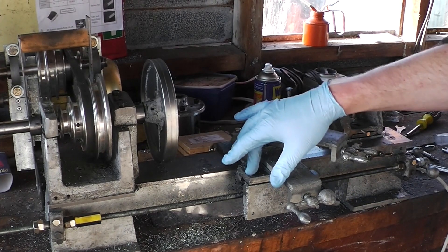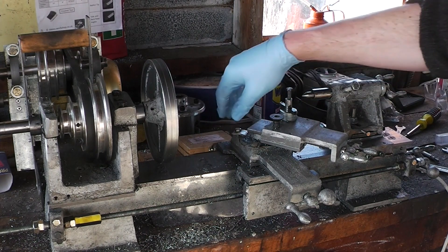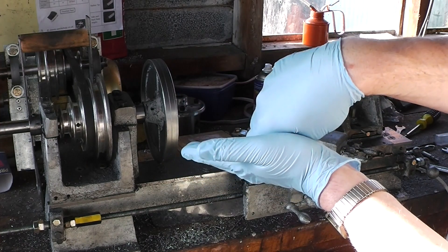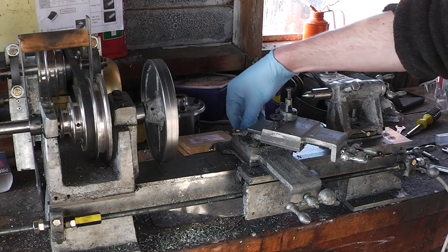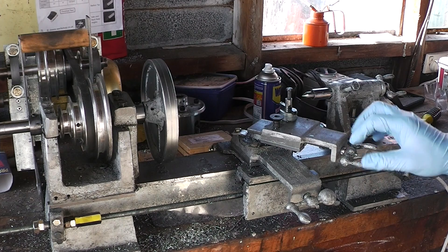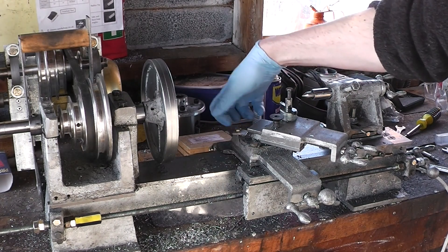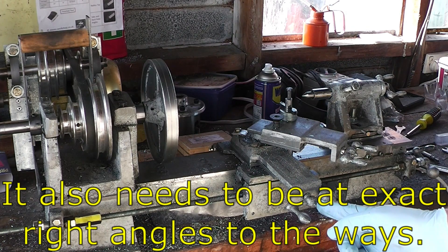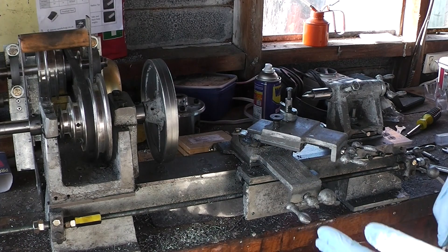Moving on to the carriage — this is class 102 in scraping, because now you've got to work in the corner, having to work your scraper without hitting the wall, so it's a lot fiddlier. Putting the ways for the cross slide on is your first real bit of precision, because it needs to overhang and it needs to have the screws so that they don't collide with the lead screw for the cross slide going through here. If you get your screws wrong, the lead screw can't go through, and then you're having trouble.